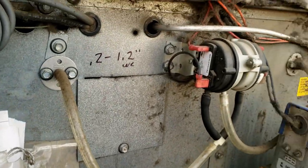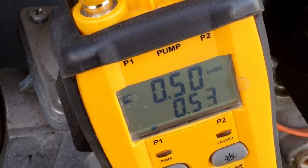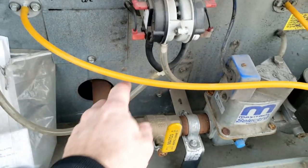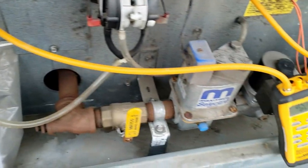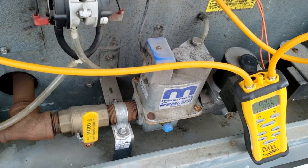We've got our minimum and maximum burner range marked out — that's the area we want to be within. We went ahead and cleaned out the orifices and cleaned the flame sensor. Checking the differential pressure: we're at 0.54. I don't think the pressure switch is an issue unless the switches themselves are acting up. We're pretty good there, so let's go ahead and kick this back on and see how the flame looks.